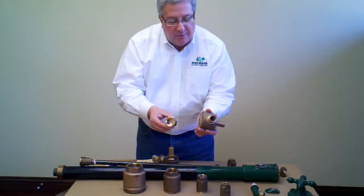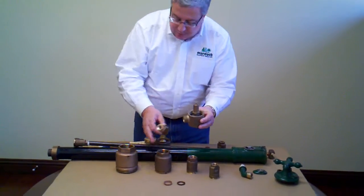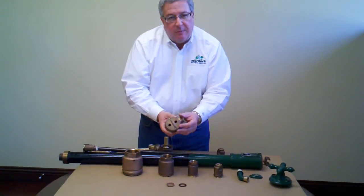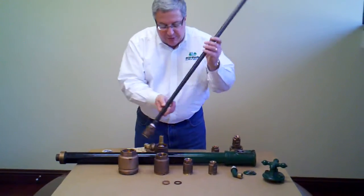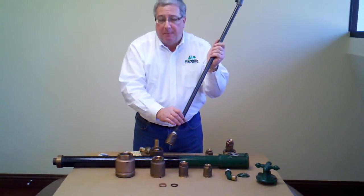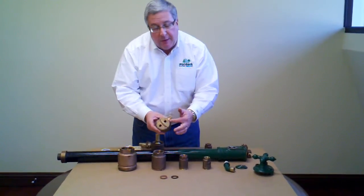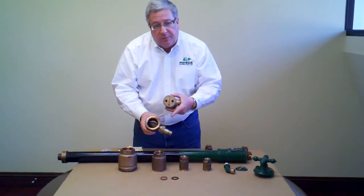This is a typical hydrant bottom connection. This valve body moves up and down as you operate the hydrant — up for on, down for off — and the water drains down and out through the weep holes in the bottom. If you take one of these hydrants apart after it's been installed for a long time and you see a scum line or even something like barnacles on the inside pipe, that means the hydrant's not draining properly — the weep holes are plugged. On a drinking fountain, this tapped two-inch opening that drains down into the sand will also be plugged up, which would be a problem.